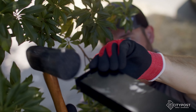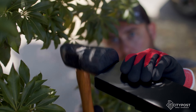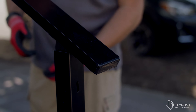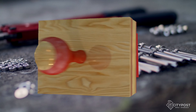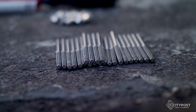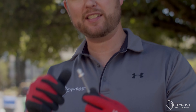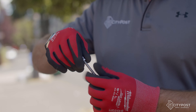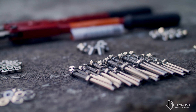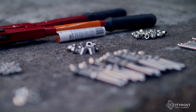The final step in the top rail installation is to plug the two ends with the end caps provided in your kit. These are PVC with UV inhibitors. Another pro tip: the night before or the morning of your install, take a few minutes and unthread the actual stud from all of your cable fittings. You'll thank me later — this will save you a lot of time when you're actually getting ready to do the install.